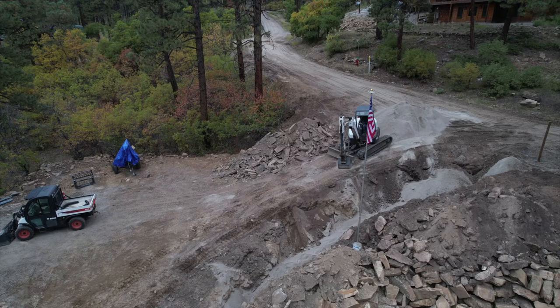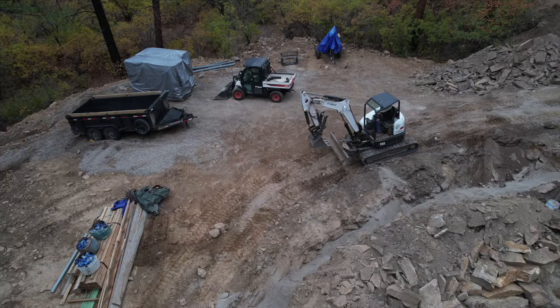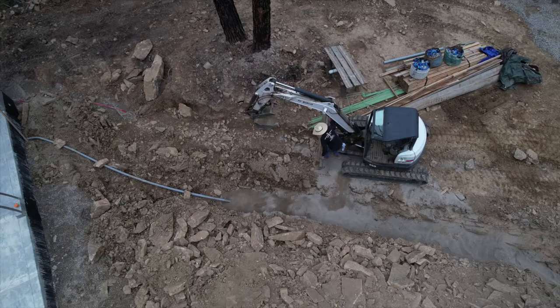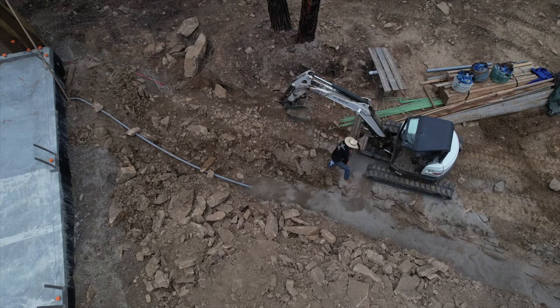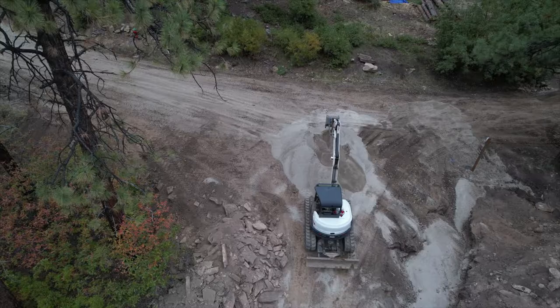Basically, if you're installing a water service in the mountains in a cold climate, you want to know how deep the frost goes — normally about three feet, but it could go deeper in a bad winter. That's why in the area that's only about three-foot-six deep I sleeved it with schedule 40, which should give me the added depth I need for frost protection. Thank you very much for watching — please subscribe, like the video, and I'll see you next time.